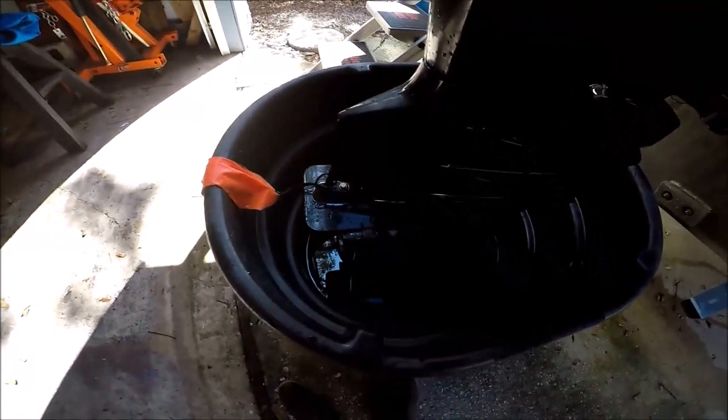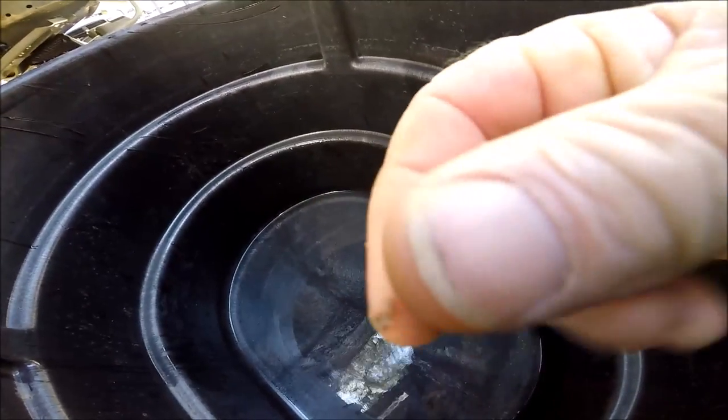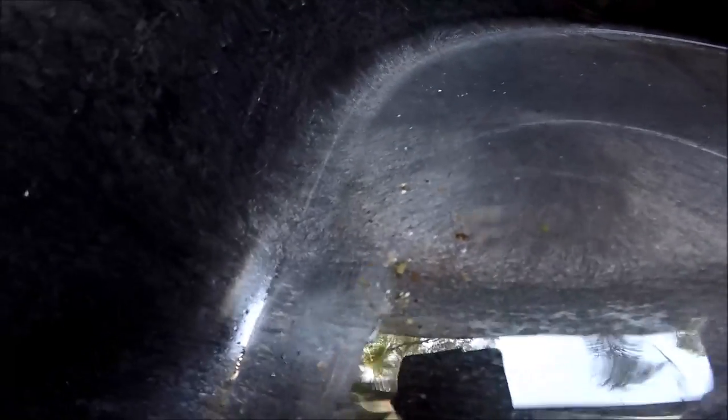I can see a little bit of debris — there's some rather large chunks of junk and some other little particulate matter. That just broke apart in my finger. There are debris chunks from changing out those interior anodes, and I was concerned that would get in my thermostat and clog it. I still may pull the thermostats — just because it's so easy to do, I think I'm going to pop the cover on the big Suzuki and check that out.